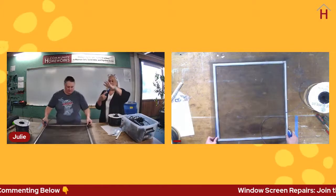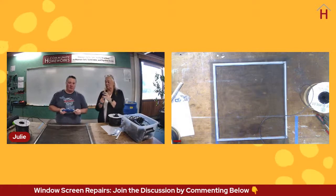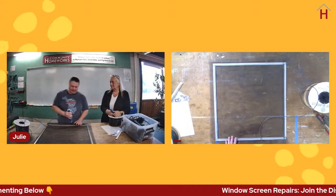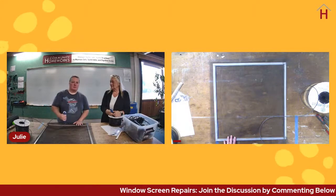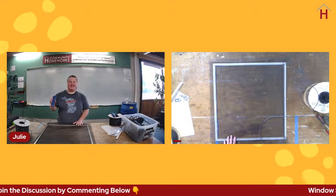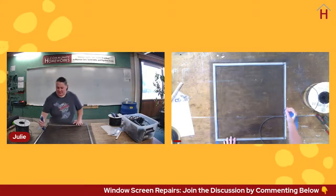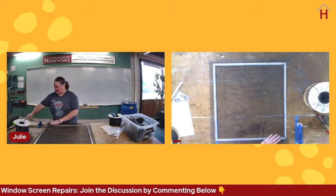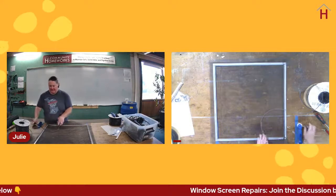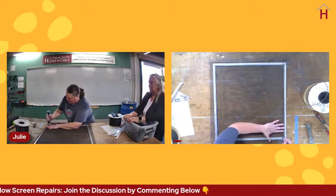And this is plastic. I mean, you can't hurt yourself with it. That is correct. It's not going to cut you or your children. Correct. I will say though that if you are overzealous with this tool and go over this fiberglass screen repeatedly, you can inadvertently split the screen. So once you've got that seated, we have a bird in here. Isn't that fun? Just a basic thing. Once you've got that seated, you don't need to go over it a whole bunch of times. You could inadvertently split the screen. So let's use that putty knife again to make sure that corner is fully seated, and that way you're less likely to have the corners pop out and then have to come back and do this again. So on the second side, I would also hold the screen.